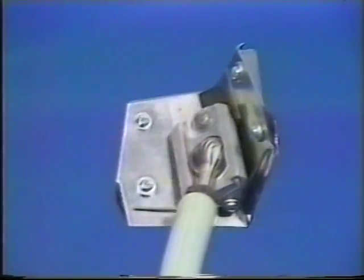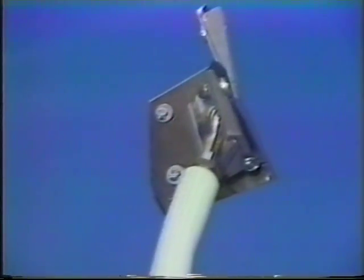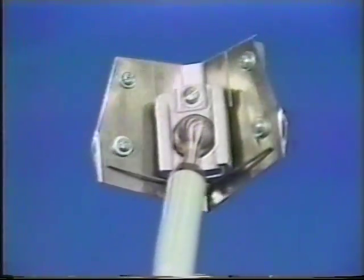Next, we see the corner flusher, which is ideal for pressing the tape into the corners and smoothly wiping down the mud. Note the ease with which the three-way corners are finished, leaving them ready for the finish coat.